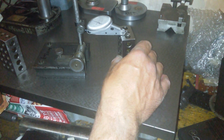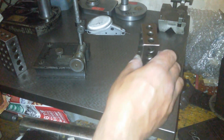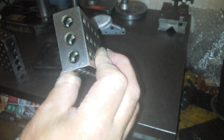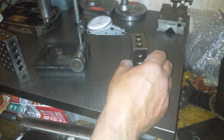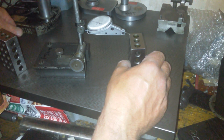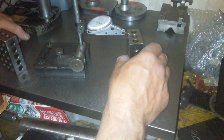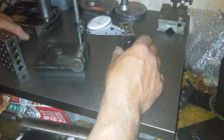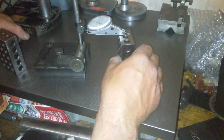So if you're willing to put 20 minutes of stoning effort into it, it looks like lengthwise, these are pretty goddamn good. That's the finish after you can see the scratch marks in it where I've been stoning at it. Well, they're that fine because it's a fine India stone that they're not even showing up. Now, for some reason, it's down at 1/10 there. Let's see if it moves up to 2/10. And my hand heat could be going into things now because I'm just resting all over it.